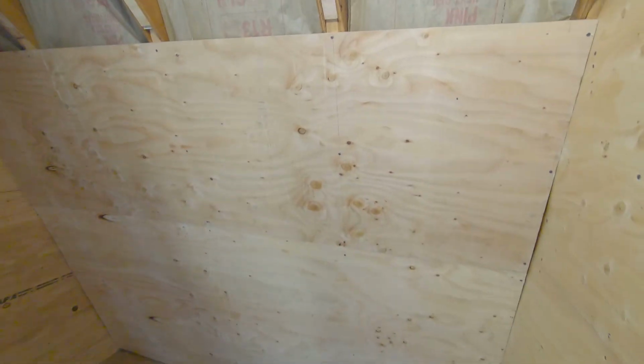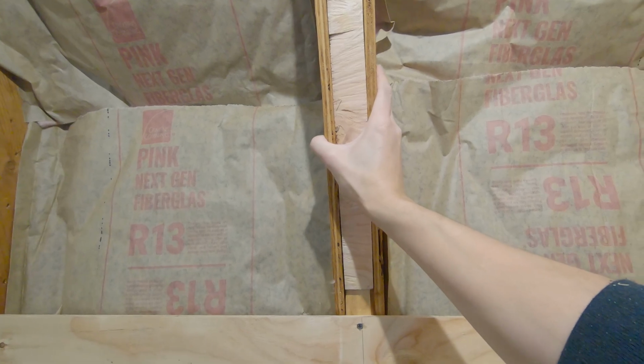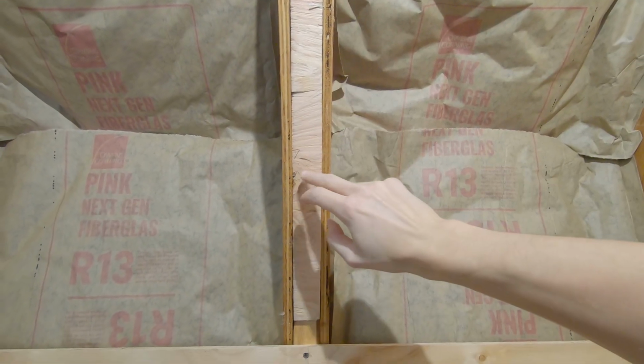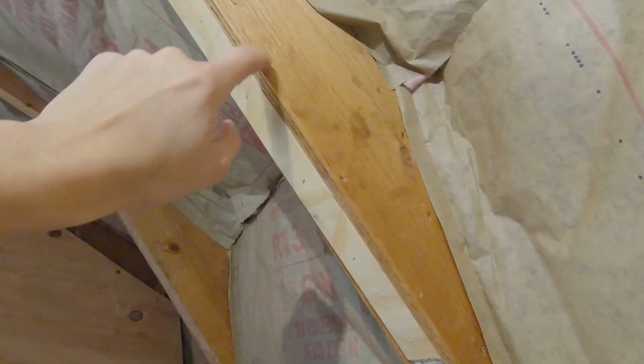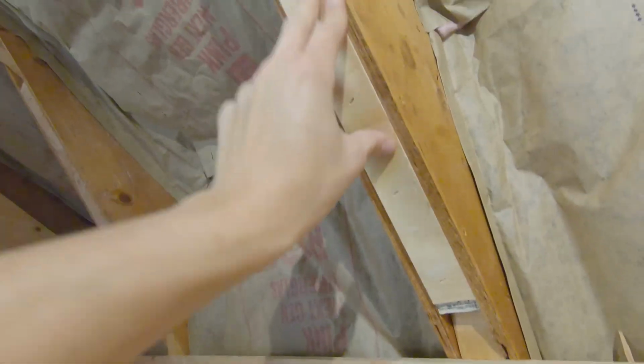Putting the interior sidewalls up now, and then these rafters or trusses, I don't know what you would call them. Well, it didn't really give us anything to screw into, so we just ripped some, I think it was 1.5 inch pieces of plywood, and then just Brad nailed it into the side so we can have something to actually screw the plywood to.